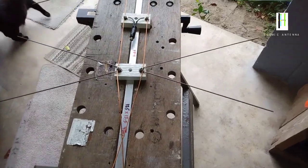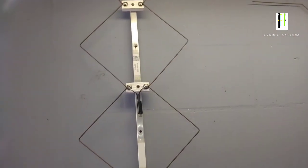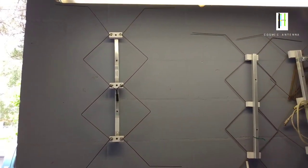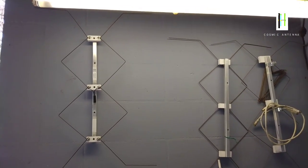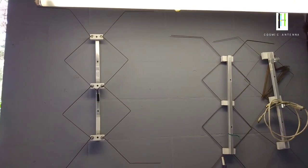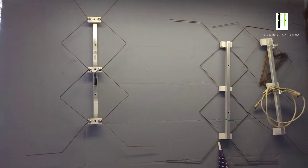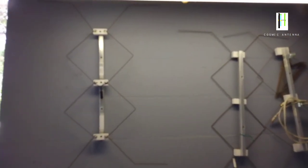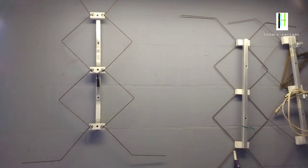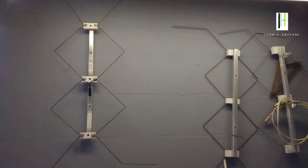I don't compare anything to a Hoverman, because the Hoverman — here's my Hoverman — still works fabulously for everything. But I could not solve my channel 20 or channel 16 issue with a Hoverman. I tried the Hoverman, I tried the four-bay bow tie, I tried several different ideas. When I went to the 12-inch or 12.5-inch bows, that solved the problem. I never figured out exactly what the interference was. But the Hoverman is still a fabulous all-around antenna.